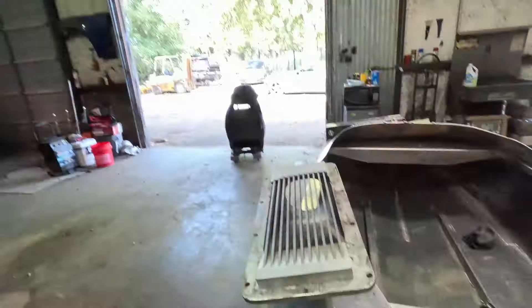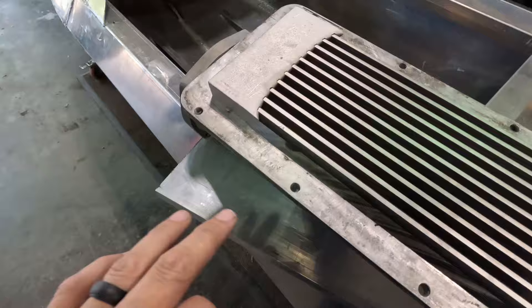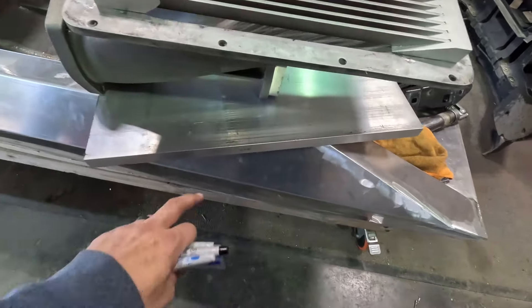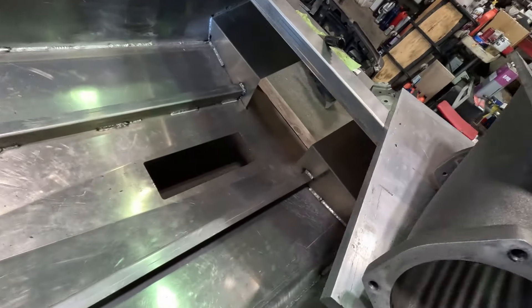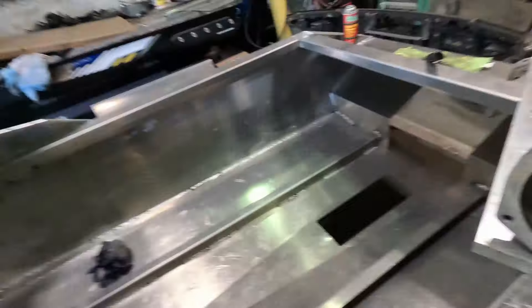In this video we're going to get the jet pump stuff finished up. I've got the intake grate here — need to mark some holes, drill some holes. I need to cut out the hole in this big aluminum plate, weld that in, weld up the transom, get it sealed up, and then we'll throw it on the trailer and go see if it floats. Let's get to work.